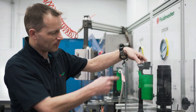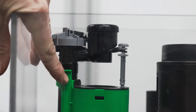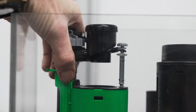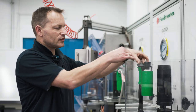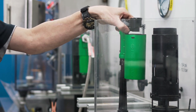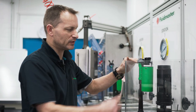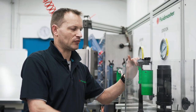We adjust the height of the valve by unlocking this chamber — on here you have an up and down arrow. We can simply unlock the valve by pulling the chamber up. Then, grabbing the whole head of the valve, you can pull it up one click at a time; there's about 6mm or a quarter of an inch for each adjustment. Pull it up to roughly where you need to be, then reclip and lock the valve back in position.